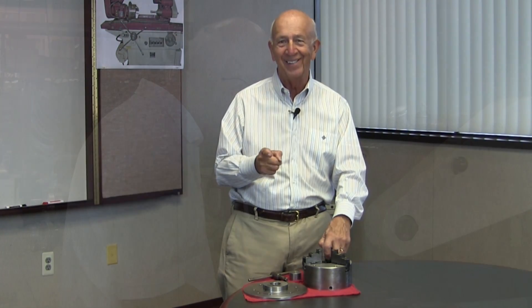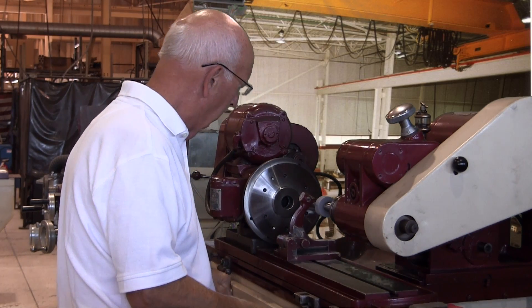So we're going to head out to the shop. We've already bolted the adapter on, and we're going to grind the face and OD of the adapter, then mount the chuck, relieve the jaws in the back, put our slug in, grind the jaws in the front, put a part in, and check it out. It's kind of exciting — let's go out back and give it a shot.